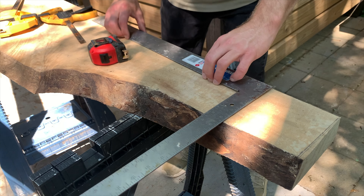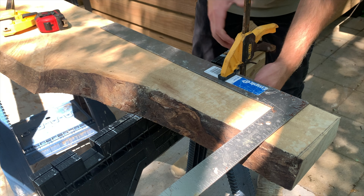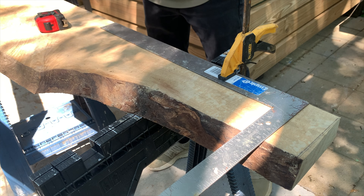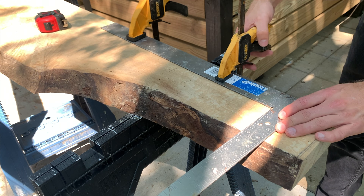Nothing needed on this side but we'll probably have to cut the far side. Instead of marking the right angle with a pencil, you can also take some clamps, line them up on the back side of the wood, and then use your circular saw running along the framing square basically as a track. Using the framing square and clamps to give yourself a perfect 90-degree angle is probably a better plan than just marking it with a pencil.